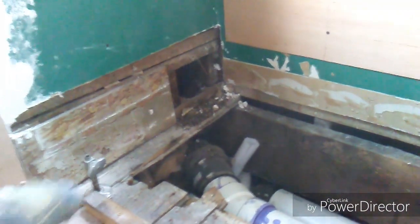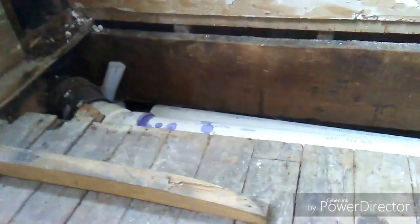And where are we going to go? Just a little hole there? Well, we can cut it right in there. We just got to get up enough to get the rubber boot to fit on it, and then we just put a short piece in the santee. This will go in the rubber boot going up, right, to get us to 3-inch, right.